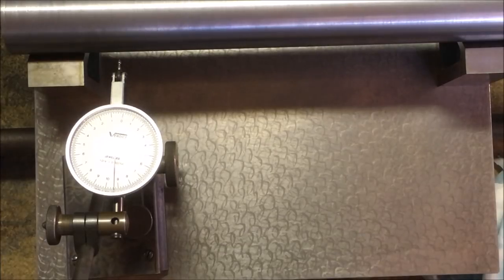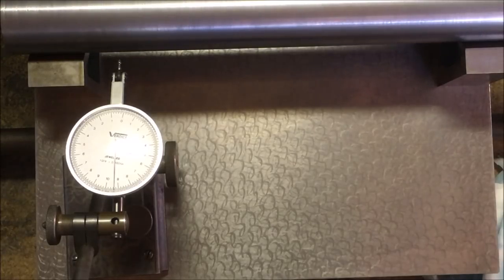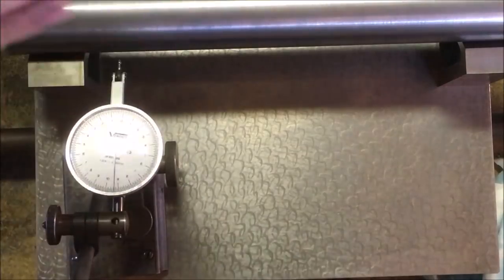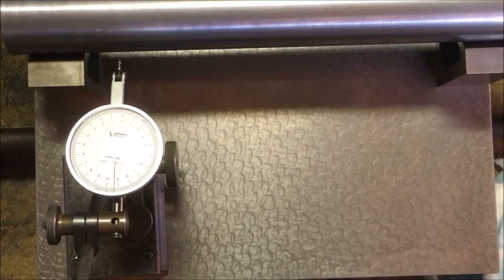I've just sat and watched a video by Robin Renzetti where he's tweaking a Deckel clone single lip grinding machine tool, and he shows how he makes up an aluminium lap and uses diamond honing paste just to smooth out and improve the finish. So I'm going to actually see if I can find a piece of aluminium and do something similar. So I need to mic that up, bore a hole in the aluminium about that wide, with a hole running through, put a slit down it and a few score lines for the slurry to get into, and then lap away. Bring you back when we're doing it.